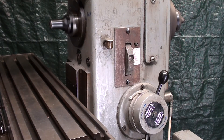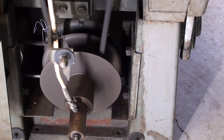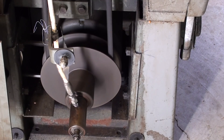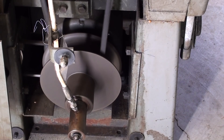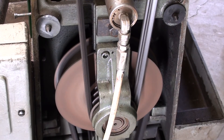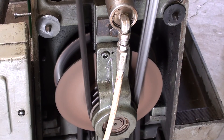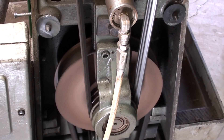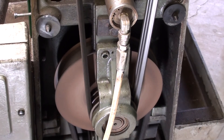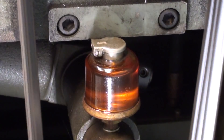That's in direct drive. The machine is running at a slow speed — watch the lower pulley as I increase the speed. It's simply a variable pitch pulley. Now watch the upper pulley as I do the same — it's just spring operated, and the lower one has a hydraulic cylinder on it. Sometimes these are called a Reeve's drive. Stay away from those belts — they'll kill you. And there is the little hydraulic reservoir; I put hydraulic oil in there.